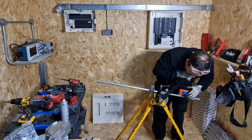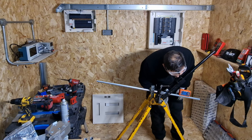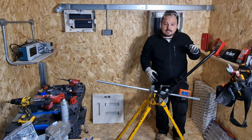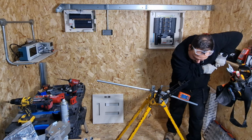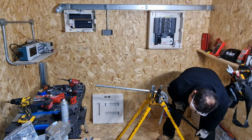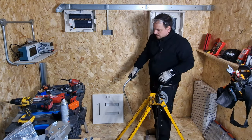We need to zero it on this end so make sure you've got it locked down tight and we'll go through that process again. You can see it's going through the process of zeroing off, trying to make sure it's got a level, and it should go to zero. We want to bend a 90 degree on the end of this, so you just start pushing. This is a bit difficult in the booth because there isn't a lot of room - I can see we're up to 31 degrees... 89.6 degrees - I'm going to call that a 90.